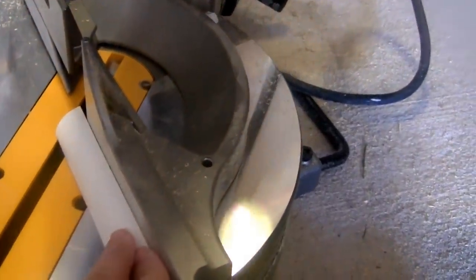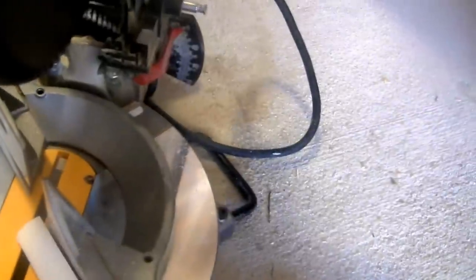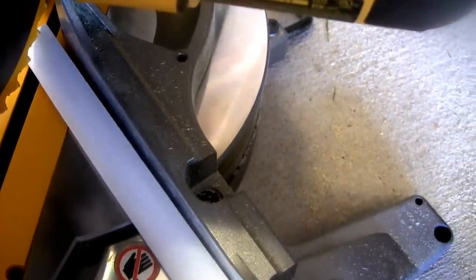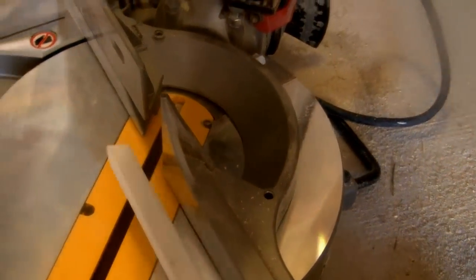Let's dig in. We'll start from the left side, lining it up. This one is straightforward — easy cut. Line it up right there at the inner edge and do the 45-degree cut. There's the 45-degree cut with the miter saw. You can see the 45 right now; haven't used the coping saw on it yet. We'll swing this around and do the same to the other side — you only need a single bevel miter saw, or another contraption that does the same thing.